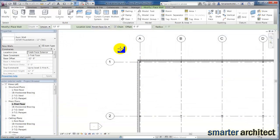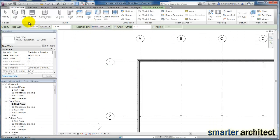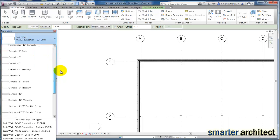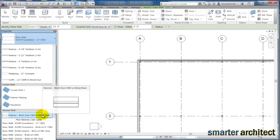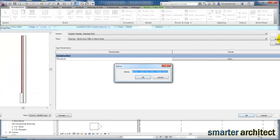Now the last wall style we need to create. If I go back to the AutoCAD drawing, you can see we've created a wall style for the 12-inch CMU and a wall style with our brick and 8-inch CMU. Back to Revit — the last thing we want to do is come to Wall Architectural and scroll down near the bottom. You'll see our Stack Wall. We're going to start from this stack wall — it's provided in the program by default. We'll click Edit Type and duplicate this wall style. So we're doing quite a bit of duplicating existing wall styles and modifying from there.